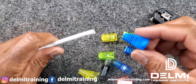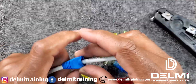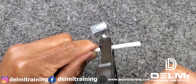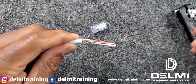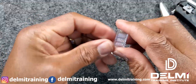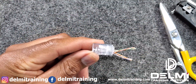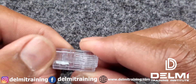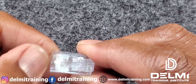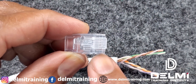If you're going to be terminating using a boot sleeve, the first thing you want to do is slide the boot over the cable, then strip out about an inch of the cable, thereby exposing the pairs. As I mentioned in some of my videos, when you hold this RJ45 connector with the release on the top, pin 1 is to your left.